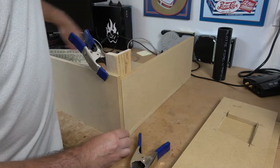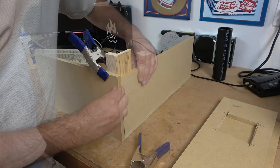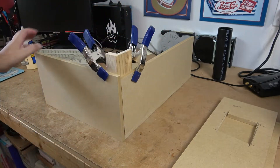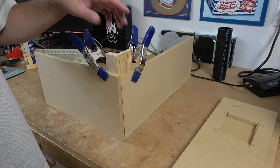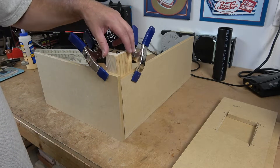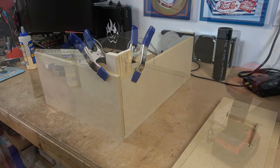Once we get our alignment, we're going to square up these corners a bit, then take our spring clamp and attach it to that side to hold the corner in place. While you can buy these jigs at the store or off Amazon, really, if you already have a table saw set up, you might as well just cut one of these little pieces, save yourself a few bucks, and when you're done you can throw it in the fire.